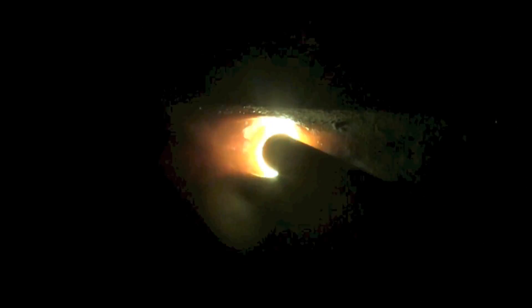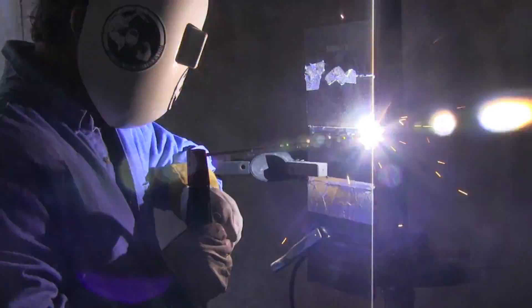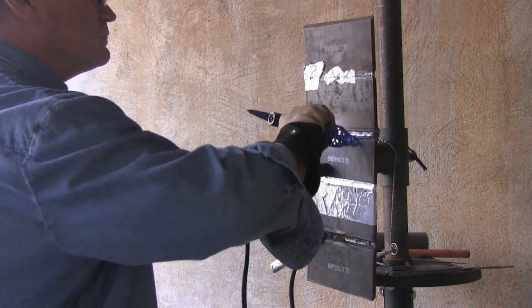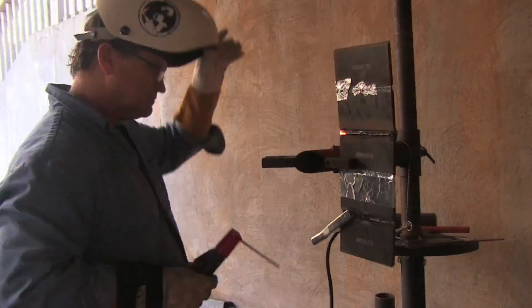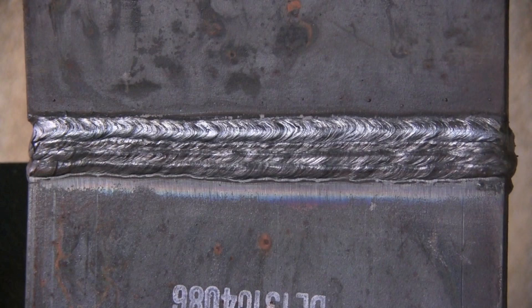I've said this many times, but I'll say it again — it's really good advice for anybody learning to stick weld or any welding student: set the machine hot enough that the rod won't stick when you hold a tight arc, then hold a tight arc. We're ready for the cover pass now. This was intended to be the very last pass — a 3-bead cover pass — but I wound up having to run a really quick one due to some slight undercut. That happens sometimes. And I don't want to say the Miller Thunderbolt is an inferior welder — this is some stick welding done uphill at 90 amps with a 3/32nd 7018. It's a good little stick welder.